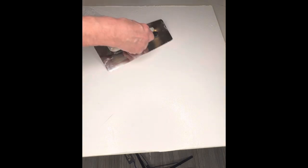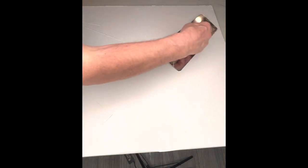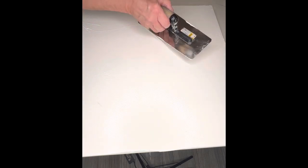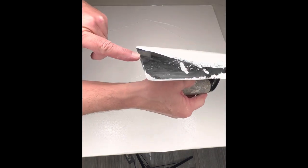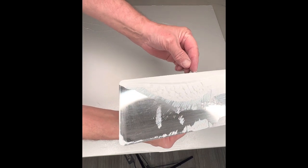What I'm using here is a combi trowel with the beveled edge, and it is handling the grain in this material perfectly. Notice the angle of my knife — by that I mean this here. A low angle is still traveling up; it's not flat. It's up about 10 to 15 degrees. Because like we talked about the other day, the edge of this is beveled right here, so those grains you see them lined up there — they're getting compressed down into this material, which will be really crucial in the next coat.